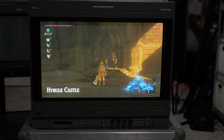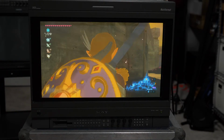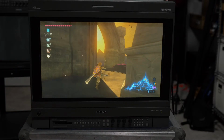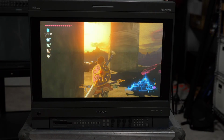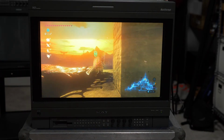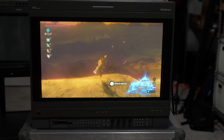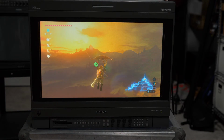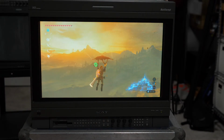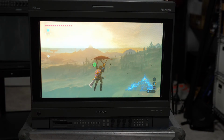Faster, safer, yeah. We went from HDMI to VGA through that HD15 to SCART, which had the passive sync combiner. That's why we used to get the curl. Now it's HDMI to component. So component video is an HD TV standard, and 720p is as well, which is why the component video converter worked, and why the VGA converter, which is designed for PC signals, VESA signals, didn't.